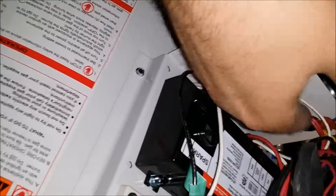We're almost done. You just want to run the new spark wire back up where you pulled the old spark wire from — feed it through and plug it in to where it says spark on the relay.